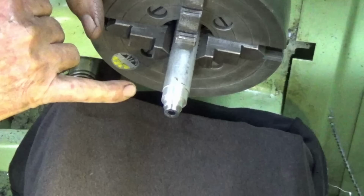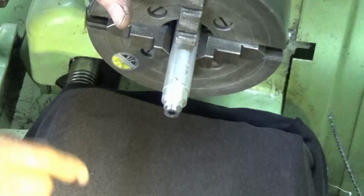The only thing I don't like about this process is that you have to use an acid flux to get a good bond with the solder. I know you can buy paste fluxes and rosin fluxes and so on, but in my view, an acid flux is going to give you a much better bond.